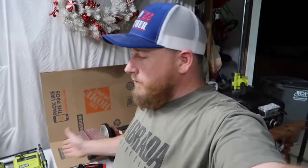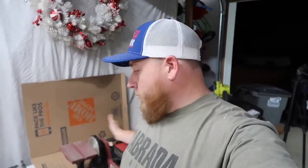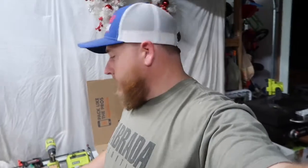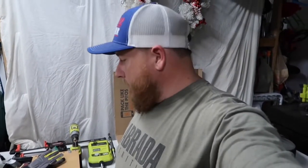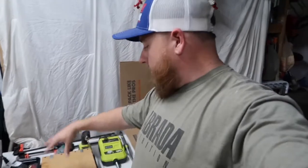That is pretty much everything I use to make my holsters, all on one table. You start with your Kydex, take your gun, cut your Kydex down to the size you need, then go straight to your little oven. Warm that Kydex up — temperatures between 350 and 375 degrees — it takes somewhere around two to four minutes to get good and hot and soft. Then go straight from the oven with your gloves, straight to your press. Load everything in the press, squish it, put all your weight in, put your clamps on, and let it all cool down.